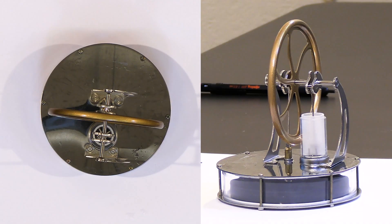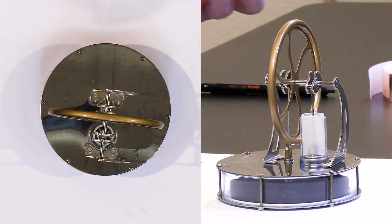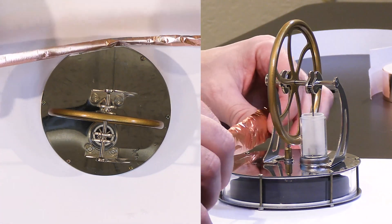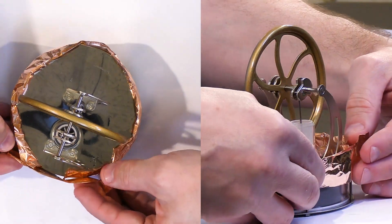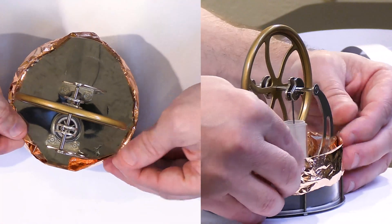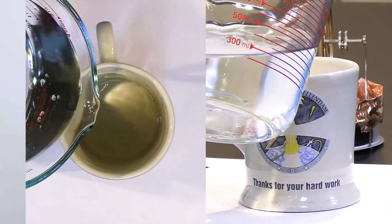What I have here is copper tape. We're going to peel this off and place it carefully — I don't want to cover up the bellows so you can see what's going on. We'll connect the last piece right in there and try to seal it, because later when I put liquid nitrogen on here it will help to contain it and also conduct the heat there as well.